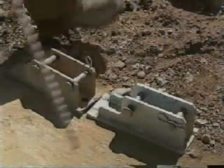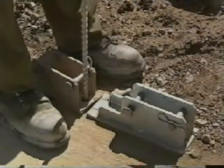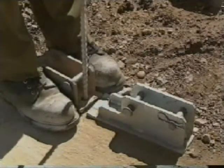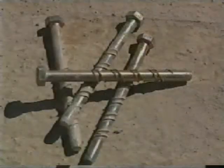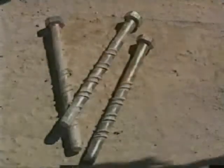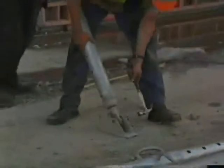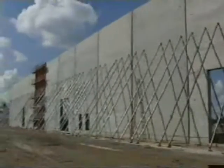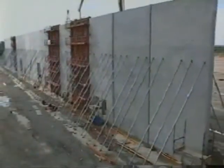This sequence demonstrates the Merlin range of heavy duty Excalibur screw bolts, for use in critical load situations which occur in construction. Here, the Merlin HSB 16-200 screw bolt is being installed into a concrete ground beam, through the base plates of push-pull rods, which are supporting the massive freestanding 14.5m high concrete firewall. The props and bolts remain in place for six months, until the firewall is incorporated within the main structure of the new warehouse under construction.